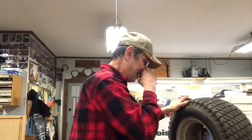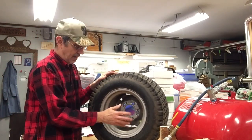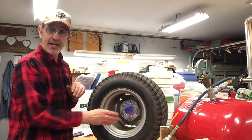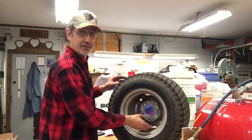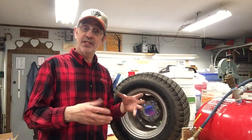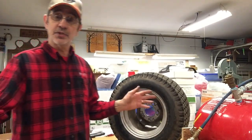But that's just with tire chains — you want some type of wheel weights. Snapper does sell a wheel weight, but they're expensive. I have one guy who showed me how he made his own: he made a plate of steel with the hub's bolt hole pattern and welded on a one-inch diameter piece of pipe. Then he went around yard sales and picked up barbell weights — round weights that fit inside his rim — slid them on that pipe and put a pin through it. Even if you go buy the plastic ones that you fill with cement, they're really cheap, a lot cheaper than factory wheel weights.